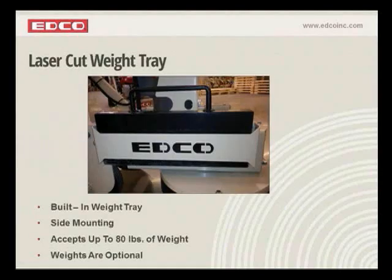So, laser cut weight trays. The weight tray in the past for the old grinders set all the weights out over and beyond the front of the machine, and it was an option. Well, we've actually built weight trays into this new grinder, and these weight trays will accept 2 40-pound weights. Also in the redesign, we've shifted a lot of the motor weight forward, so you're getting a lot more weight over your tooling, or I guess the head pressure per tool is much greater. They're mounted on the side, and of course the weights themselves are optional. But we have that on both the electric and gas machine.